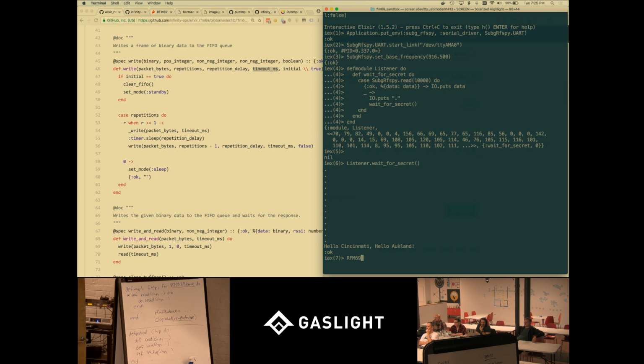Yeah. So the way you do that is rfm69.read and then a timeout, so do 60,000. And it should just sit there. Reading. All right, so I'm going to write you a message. And Alex, if you're kind of stuck, this is something to watch, except you'll be using the RFM69 module. So I'm going to send it one time with no delay, and I'll put 6 seconds on here. It's almost immediate every time. But yep. Did you get something?